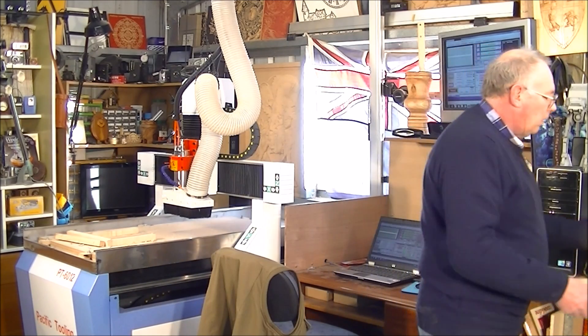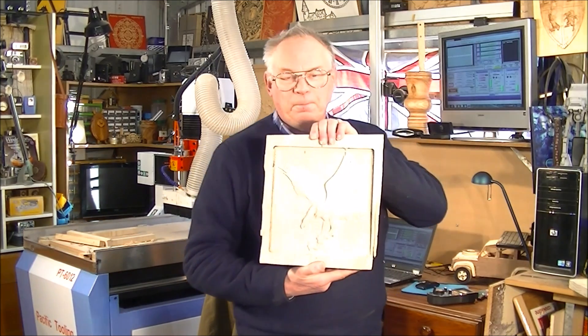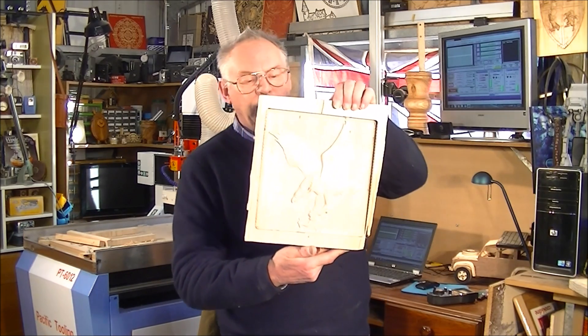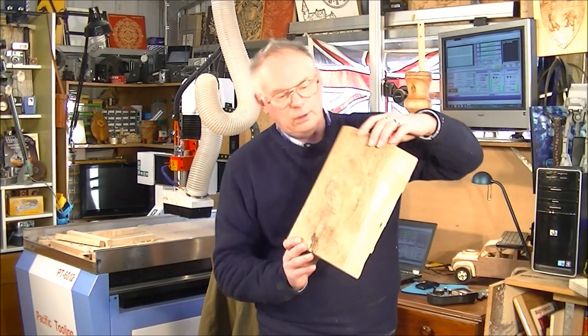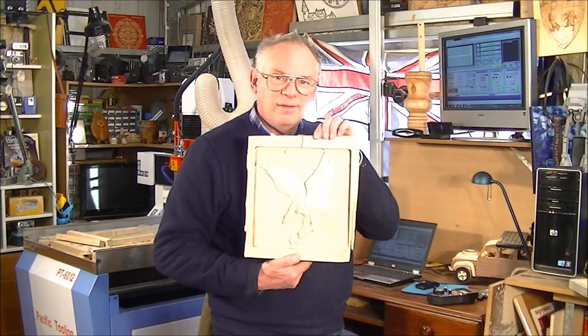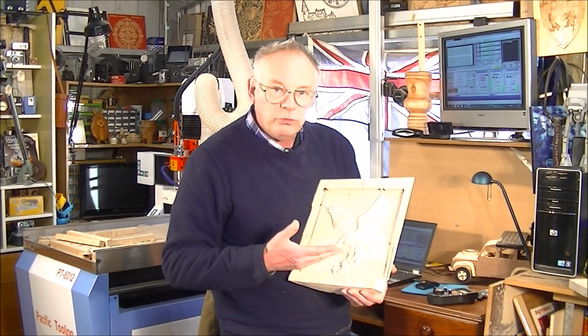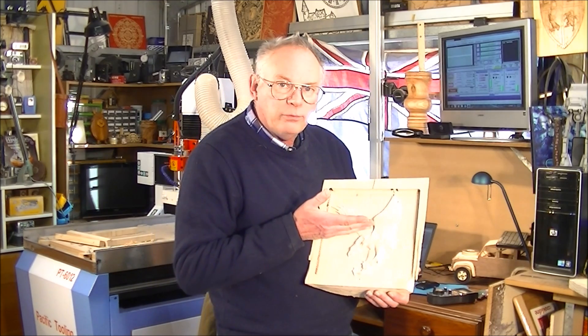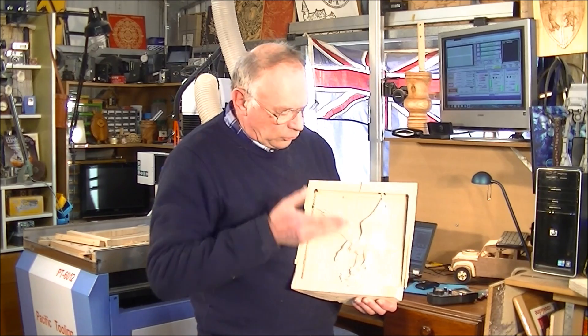I hope you've liked this video of cutting the eagle today in a piece of firewood — that's all it is, a piece of firewood oak. It's quite surprising — if you finish this in cedar oil or linseed oil and put it down it looks like a piece of firewood, but if you turn it around: spectacular difference. I've done this strictly as a demonstration of finish — I wanted to show you the step over, the result of 0.3 versus 0.24 step over. Step over makes a big difference.